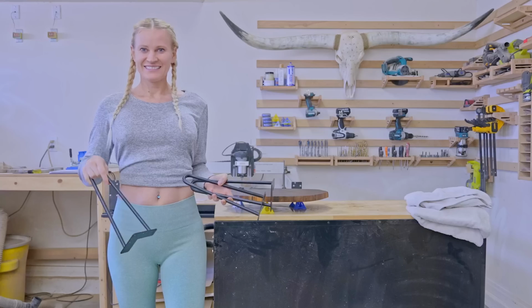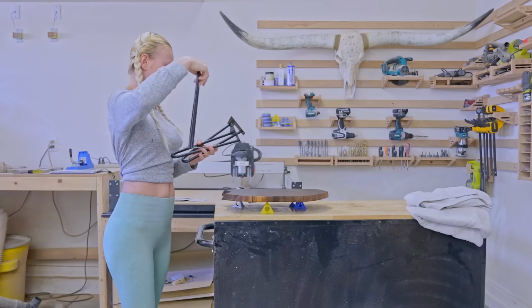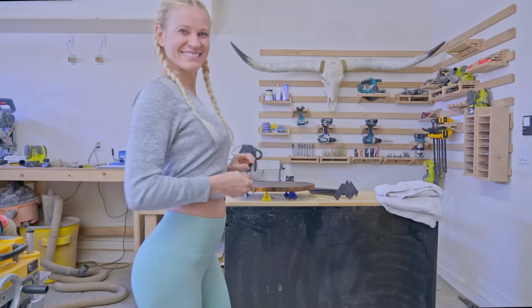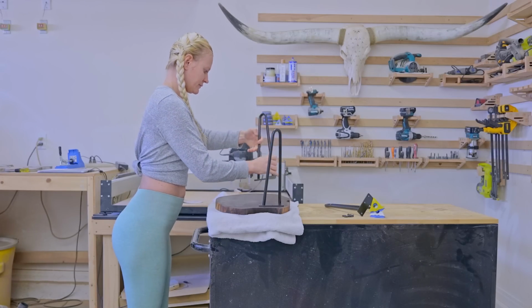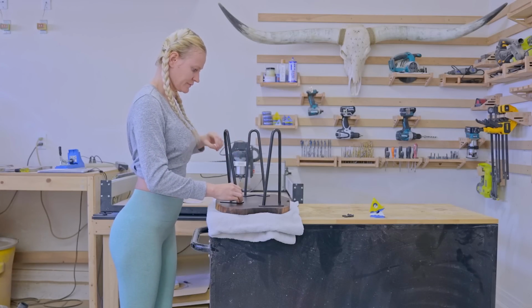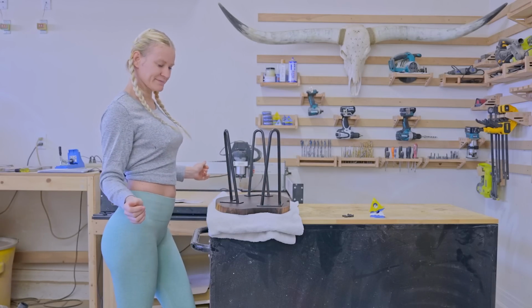Now you have essentially two options. Make the board a table by using table legs and screw them to the bottom, or use rubber feet and make it a serving plate. I can imagine some good cheeses with some meat and some fruits on it. Lecker! This time I went with the table. Make sure you pre-drill all the holes, then insert the screws. I only chose to use 3 of the legs since it is a very small table, and 4 was simply too much.